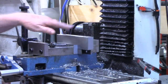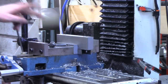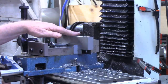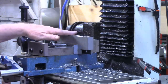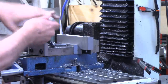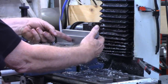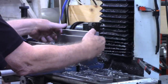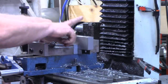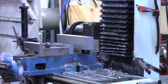Okay, I've got both of what will be the fixed jaws — got the holes drilled and counter bored. Now, one of these is completely finished. This one will match up with the third piece. There'll need to be a hole through this one — it will be drilled and tapped for half-13. There'll also be some guide pins, but they'll come in the next step.